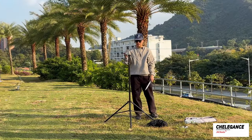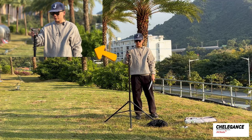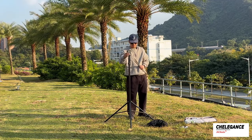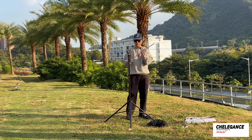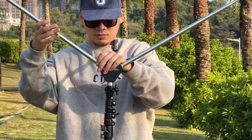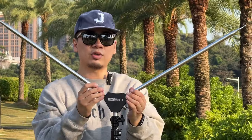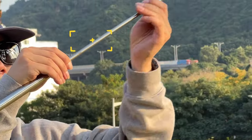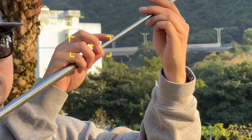Now let's assemble the MC599. First we mounted the antenna base on the tripod. This base also serves as a balun for our antenna. Next we install the two antenna whips. We use a 14-50MHz marker system on both of our retractable whips, a feature that greatly simplifies the tuning process.